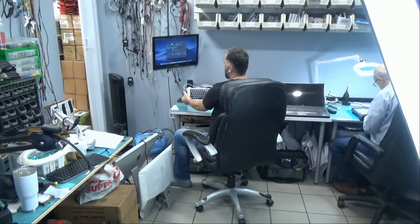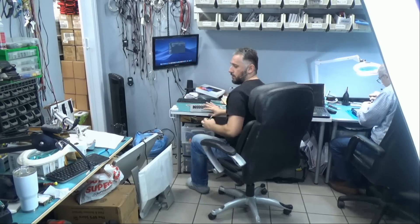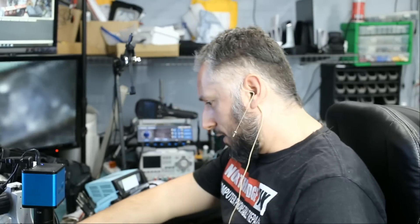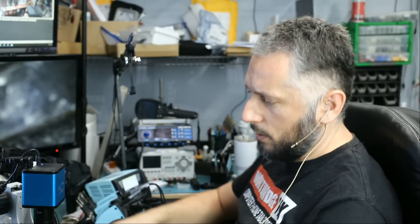The drive is not recognized on the Mac either. I thought I would do a couple of Xboxes in this video, but Big Boss has to leave and we'll continue tomorrow. Right now he's opening up the second Xbox so I can work on it while he's out. That's it for this video — we fixed the Xbox by changing the retimer chip, and we previously changed the HDMI port on that Xbox. As for the flash drive, I'm going to have to replace the socket because I believe it may be internally damaged. I'll change the socket and try again to see if we can read any files from that drive. I hope you enjoyed this video — don't forget to like and subscribe, leave a comment if you have any questions, and we'll do something else tomorrow.